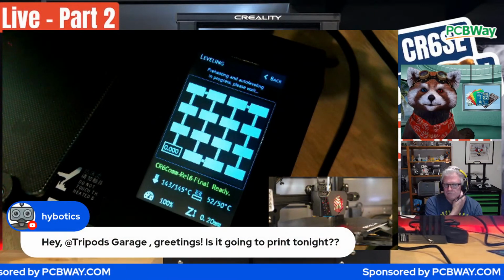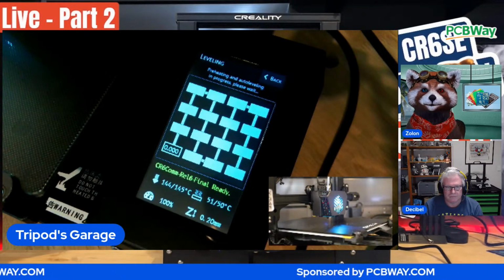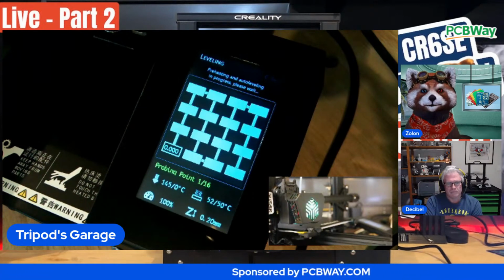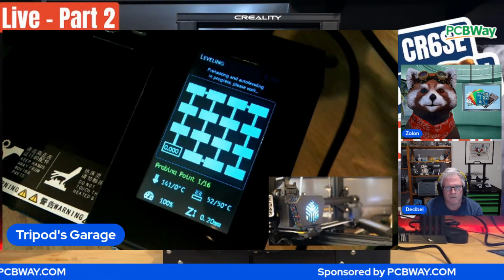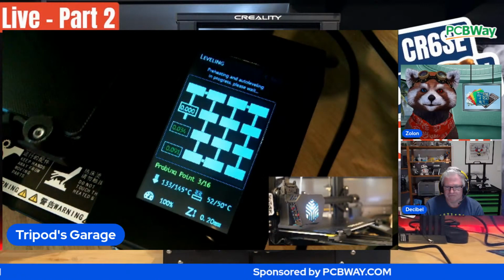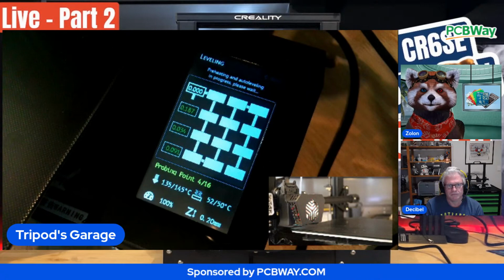And you can also manually. I think it's going to print. And unfortunately, the leveling on this does take a while. So there we go. What's your offset? 0.2 is set to the default at the moment. Yep. We'll see how bad this mesh is. I'm not going to mess around with anything except for the Z offset when I print. So I'm not going to really dig in, but I just want to make sure your mesh should be fine. Oh yeah, look at that one.